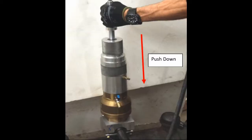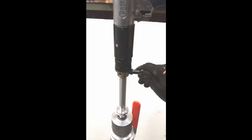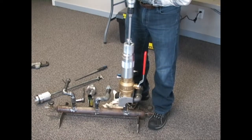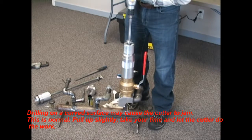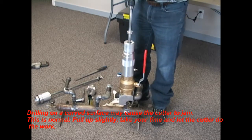Using your hands, gently push down and turn the drill shaft slightly until it travels through the elbow housing bearing and is felt touching the top of the elbow. Fasten the shaft collar 2 inches from the top of the housing. Fasten the drill onto the drill shaft hex and tighten using the drill chuck. Begin drilling by lifting up slightly on the drill shaft and depressing the trigger. Gently lower the drill shaft so it comes in contact with the top of the elbow — do not push down on the shaft. The weight of the shaft is enough to drill through the elbow. Keep in mind that you are drilling on a curved surface where only half of the bit is drilling into the elbow.